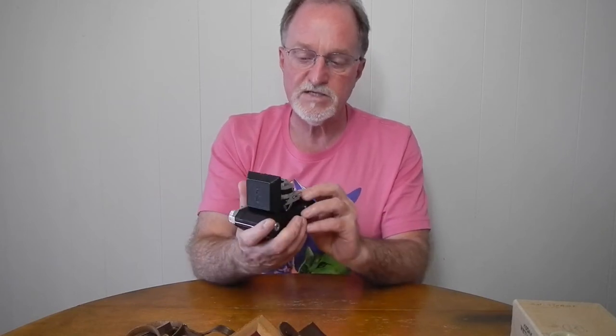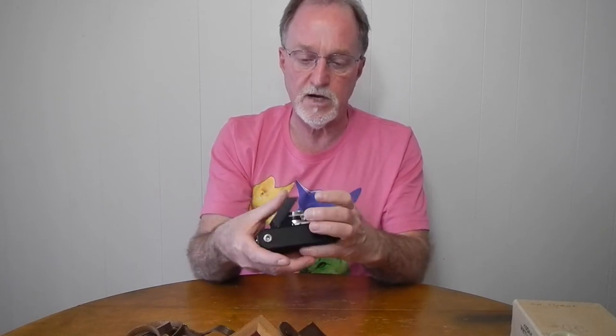It's a little bit strange. The double exposure prevention is actually preventing the shutter switch on the body, but that is tripping the shutter switch on the shutter. To work it, you do have to wind it — it's not going to work right now because there's no film in it — and then you still have to cock the shutter, and then it's ready to go. It won't fire right now because of the double exposure prevention.